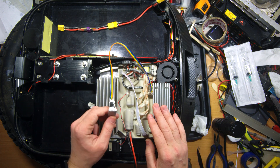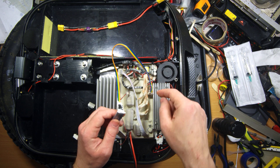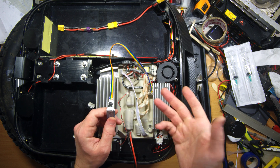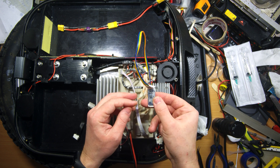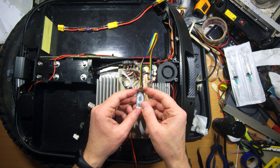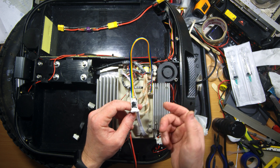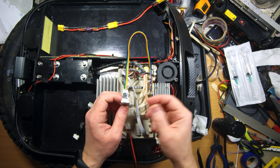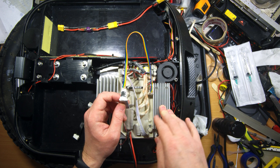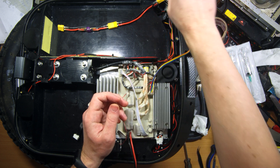The next problem I had to tackle is that the custom radiator here is really close to the controller board, so it was not possible to install the Bluetooth module in its place — it is kind of wider than this connector. So I had to make a custom extension for it from wires with DuPont connectors, which will also be available in the description. It's really easy to install and will be located somewhere there.